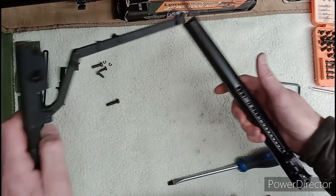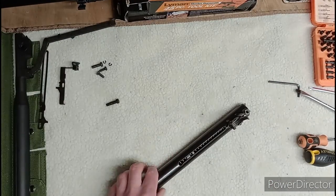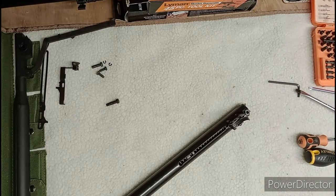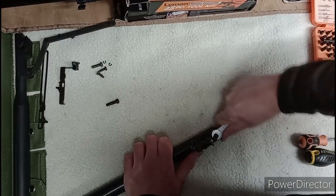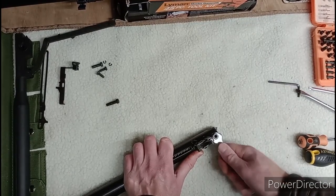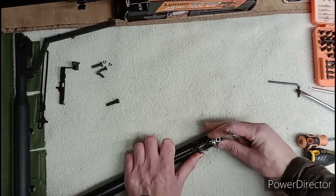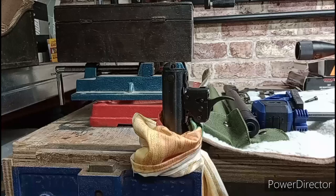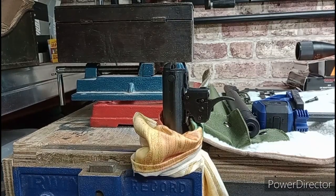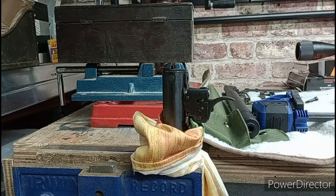Okay, there we go. Just unhook the mechanism from there. It's very dry, this gun - very, very dry. We end up with this. Looks like a 10mm. And the 10mm has not been subject to a rounded-off head, which is good. There's still evidence of thread lock. I've got the cylinder of the air rifle fixed in - what Mark Novak would call a universal work holding system. I've got to get this pin out - ordinarily on these guns I'd use a clamp, put pressure on it, then safely relieve this pin and get it out.